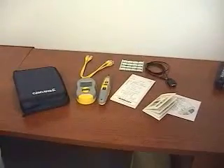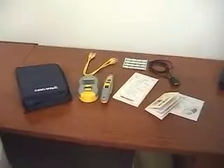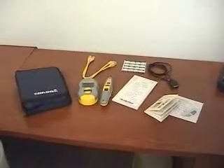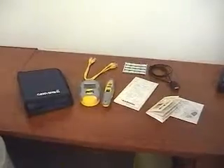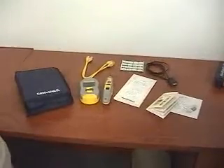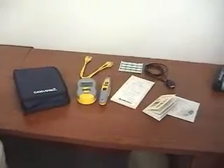What is the Real-World Certifier? It's a tester that does all of the most common tests that you would expect it to perform on cables — like give you an accurate cable length, tell you whether the cable has an open, a short, or a split pair. If it does have a split pair, how many feet down the cable is that split pair? How many feet down the cable is that open? In other words, you expect some good troubleshooting tools.